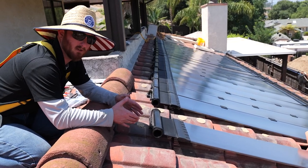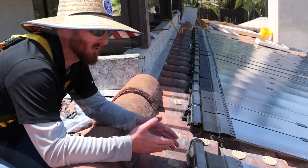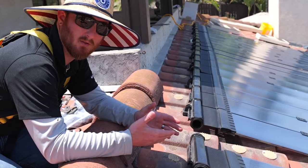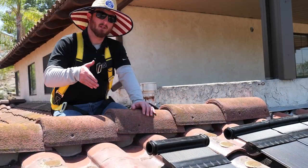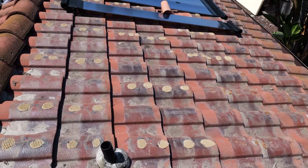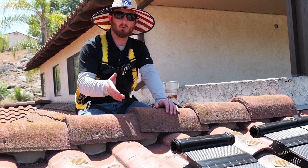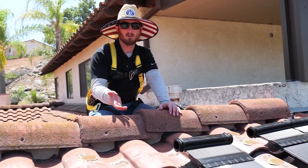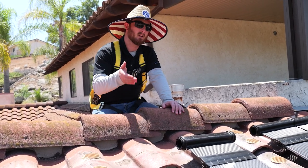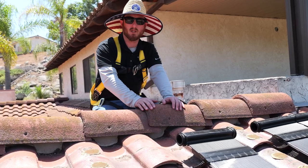One really good benefit to the Swimlux system is that the panels come in one-foot sections. With those one-foot sections, you're able to squeeze more square footage onto your limited roof space. For this installation, there are two roof obstructions about six feet apart — not enough space for two four-foot-wide panels. So I'm going to install one four-foot-wide panel and two one-foot sections to maximize this roof space.